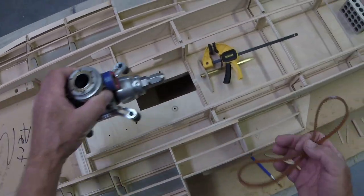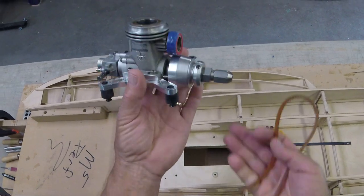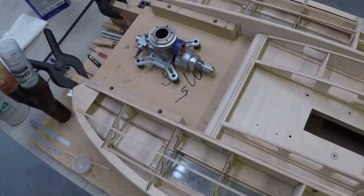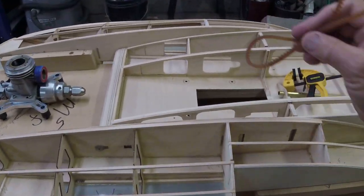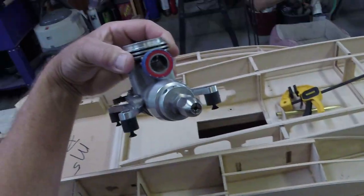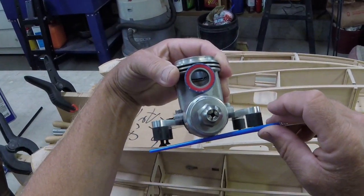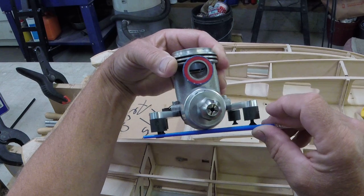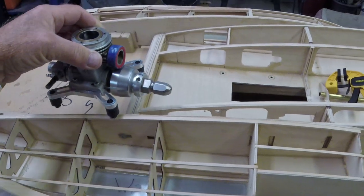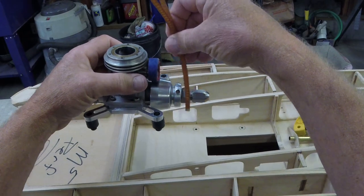The reason for an engine well: since we're racing this boat and we're serious about it, we want to get this massive weight down low in the hull as low as we can get away with. So we cut a hole. As you can see, we can't sit this thing on the ground because of the rubber mounts — it's going to sit too deep. Secondarily, we need to be able to get the starter belt on and off the flywheel.